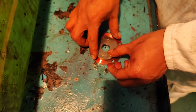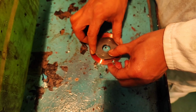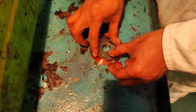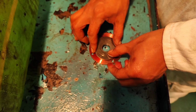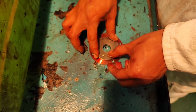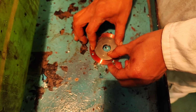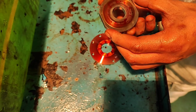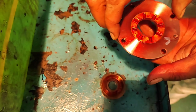need for replacement. If a long, deep scratch of 20 mm in length or greater is found on the thrust bearing metal surface, or if multiple deep scratches add up to a total length of 50 mm or more, replace the thrust bearing with new ones. Any visible exfoliation or cracking of the thrust bearing metal surface also indicates the need for replacement.